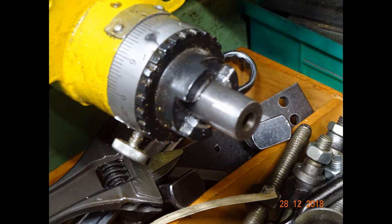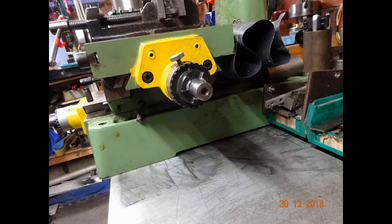The principle is to make a couple of driving dogs which easily fit into the end of these handheld drills — one of which fits the cross slide and the long slide on the milling table, and one of which slips over the hand knob on the lathe cross feeder.